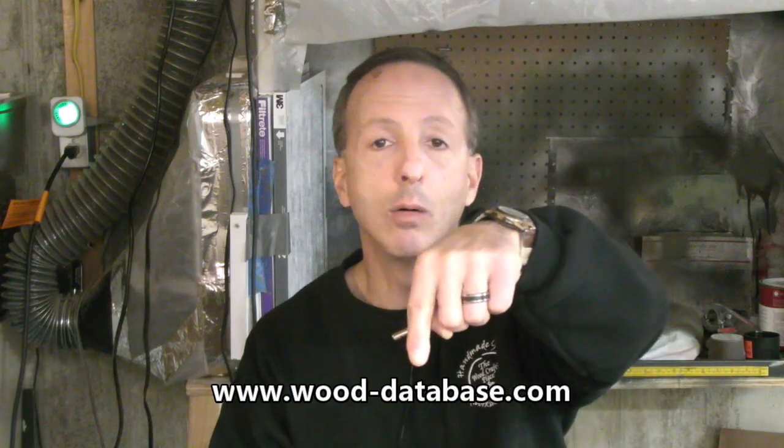Check out the wooddatabase.com. I'll put a link down below. Great resource. You can look up hundreds of commonly known woods. You work with maple, one of the most common woods today. You buy it at a big box store. And this can cause skin irritation, runny nose, asthma-like effects, and has all kinds of possible sensitizing effects. So you'll want to know what the material you're working with can cause.